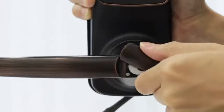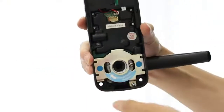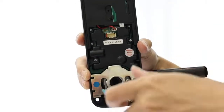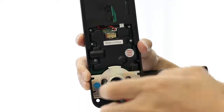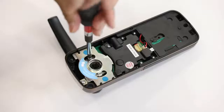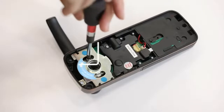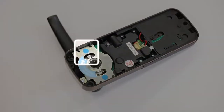Remove the key and close the keyhole cover. To change the orientation of the interior handle, unfasten the release screw on the inside of the interior assembly and change the orientation of the handle as needed. Fasten the release screw to secure the handle at the desired position, aligning the release screw hole with either of the blue dots.